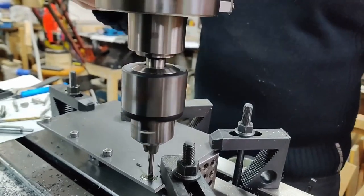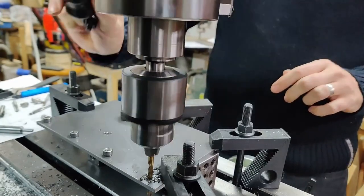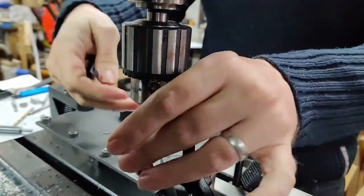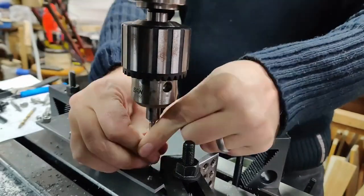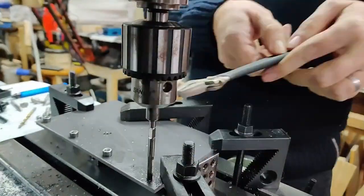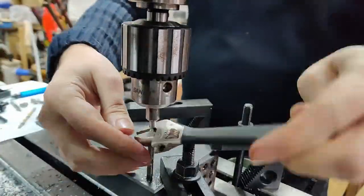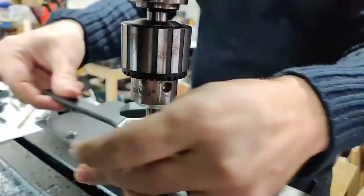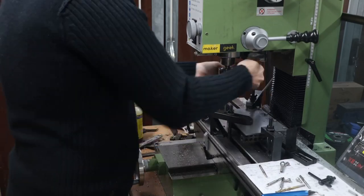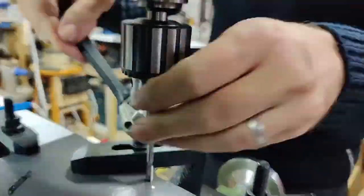So as I say, a lot of tool changes. Spot drill to mark the point, switch to regular drill to drill through — this is the tapping drill size for an M5. Chamfer the hole; I like to chamfer before I thread. This is my homemade tap follower, which is very useful in this project. Just run an M5 thread in and out. As I went along I was threading bolts into the holes to check the thread was good and to avoid debris getting down into the threads.